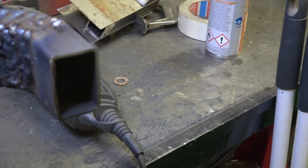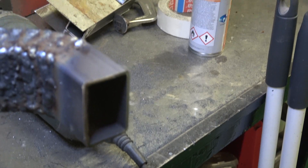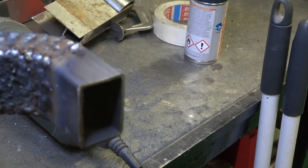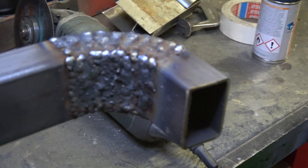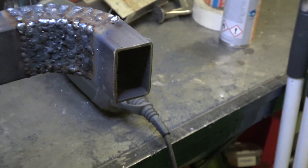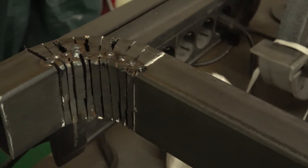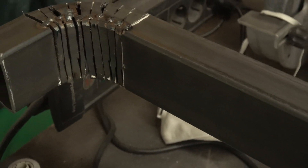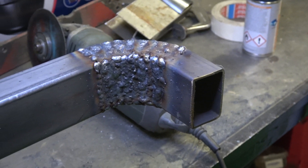I'll give you an idea of just how much work is involved in making a bend like that — you can see how many plug welds there are to do. Obviously grinding is involved, and you grind and then find a little pinhole and have to go back over it. It's a lot of work to make one corner. I'll show you in the next clip when it's cleaned up — this one has been tacked, I've adjusted it slightly, then I'll weld it afterwards.